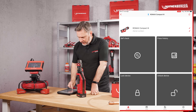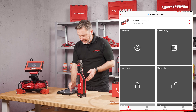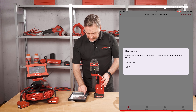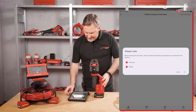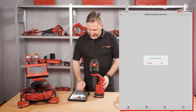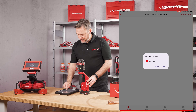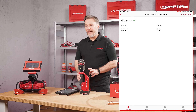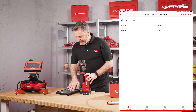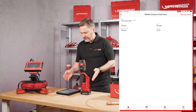You have all different features, so you can do a quick self-check. To do the self-check, please ensure you have a press jaw and a battery in place. Press OK and now you're ready for the LED test. You get a flash of the LEDs flashing red and green, which tells you the LED has passed, the trigger has passed, the motor has passed, and it also gives you the voltage.